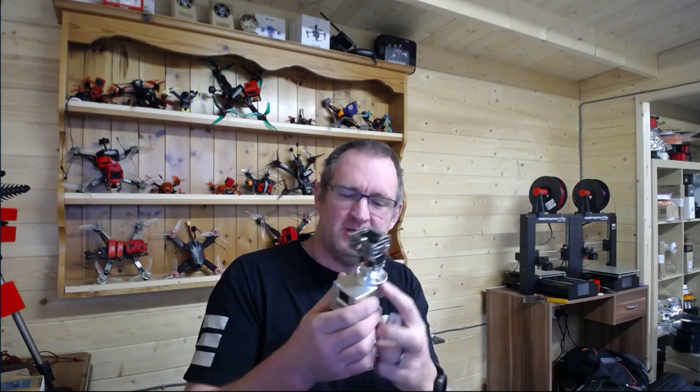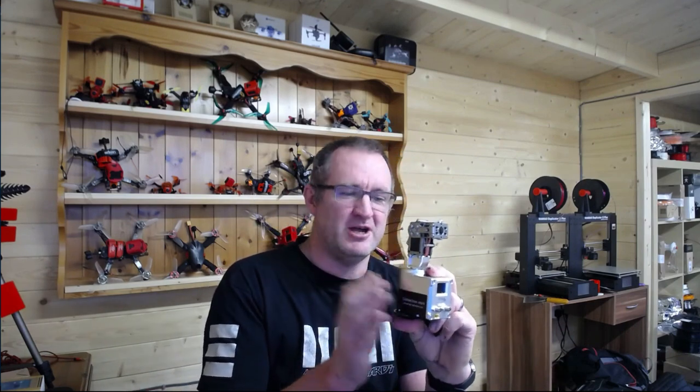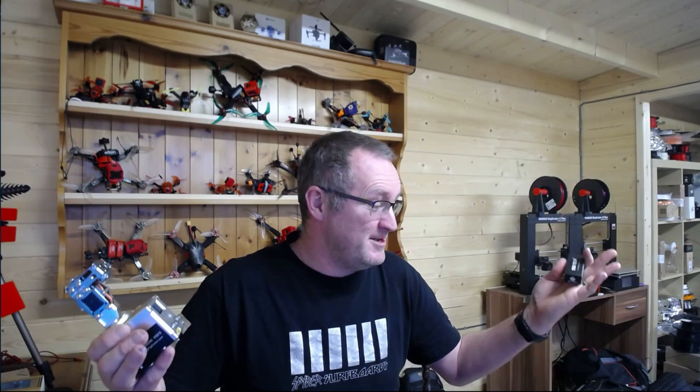For those of you interested, the reason you do this: the MFD mini crossbow tracker is fantastic, and what's particularly cool about it is it receives data via Mavlink, which means you can bind with the Bluetooth module to your crossfire and receive telemetry information. That means the tracker relies on the data link from your crossfire setup, which is great and makes life really easy. So how do we do it?